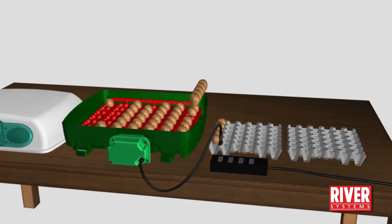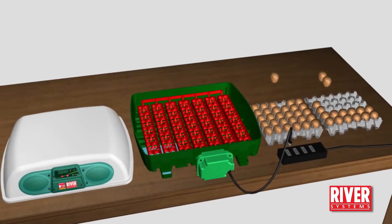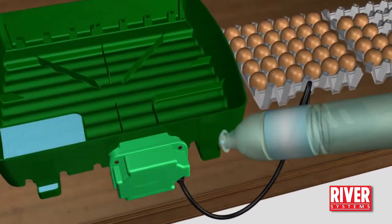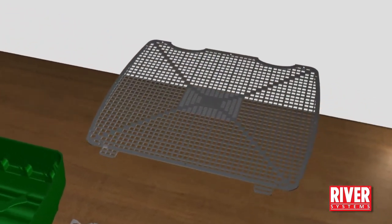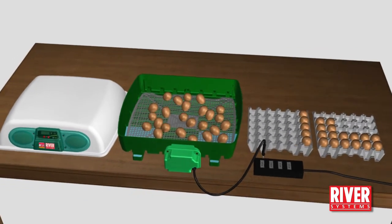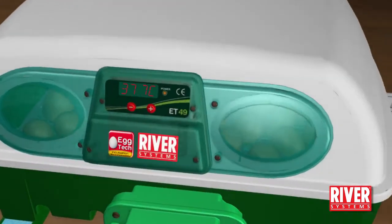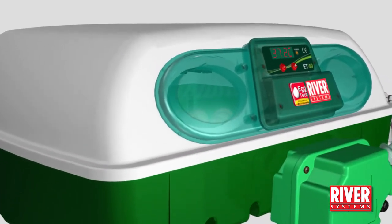Remove the eggs from the egg tray and place them temporarily on a normal egg tray. Remove the egg tray from the incubator base, paying particular attention to the part connected to the egg turning unit. Fill the second basin with warm water. Place the hatching grill in the correct position and lay the eggs on it, ensuring it covers the basins and the connections to the openings. Reposition the lid and do not open it until hatching is complete. Do not plug in the egg turning unit. Set the temperature at 37.2 degrees centigrade. Monitor daily the water level and, if necessary, top up without overflowing both basins using the opening in the legs.